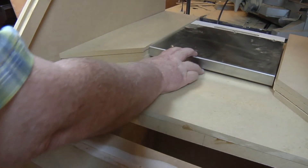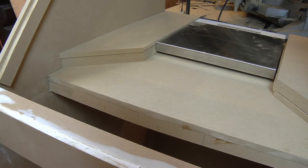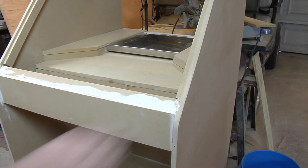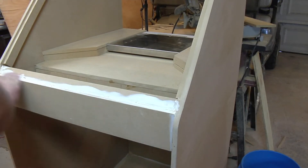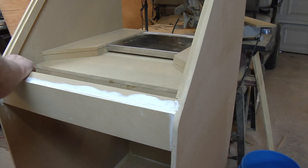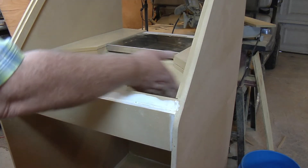I was thinking about putting in the motor today and I went into town and got some paint. So I'm going to go ahead and get this cabinet all painted — white on the inside and black on the outside. Now before you start sanding you really need to go over any areas that you put caulking on, just make sure it's really pretty smooth. If you paint it and you see it's still kind of rough looking you can always hit it again, sand it, and then you might have to touch it up some more. Go ahead and hit all this black. I need to sand the front of this right here and make it nice and smooth.